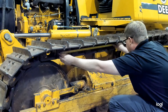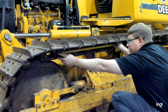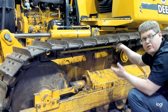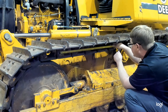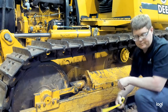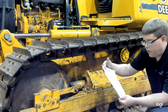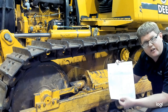We're measuring to this point here. In inches, it looks like I'm just under 25.2. On the millimeter side — and it's good practice to use a light to read this clearly — it looks like I'm at exactly 639 millimeters. When we compare that measurement to the specifications, we'll see that 639 millimeters, or 25.2 inches, indicates it is exactly 0% worn.